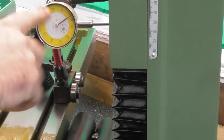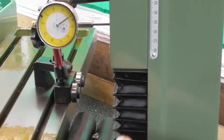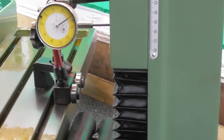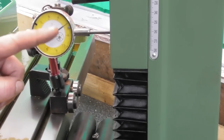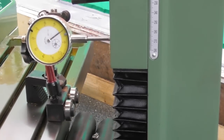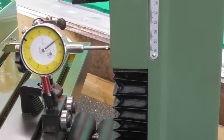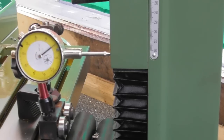I got sort of within a hundredth on the clock and I dogged the bolts down. It jumped around a bit. I've given it a little bit more tap. The bolts are now 90% tight, a little bit more to go. There's the zero on the one end, and you've got a little bit of wavering as I'm winding the handle. I think the gib on the table could be a little tighter, but I don't think that's a huge problem. And I'm within a hundredth. So I think I'm going to call that the starting point for now.